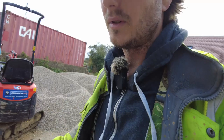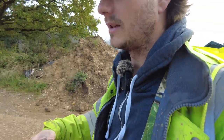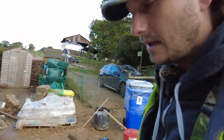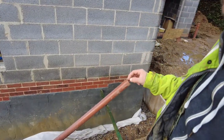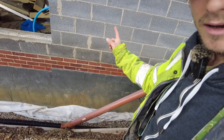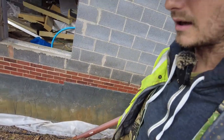Dan said, right, before we start digging it out, let's just get this wrapped up and done before it collapses again. So we need to get all the shingle in. So I'm going to jump in the big digger, and we'll just do it with buckets and just do one section at a time. I'm going to change this because this is like a rodding point, whereas I only need a jetting point because I've looked up the jetting kit that I'm going to get. So I'm going to kick that so it goes up that way. We're not going to change that fitting, or it's already down there because it's already done. We'll kick it up there.